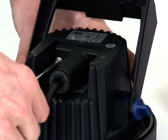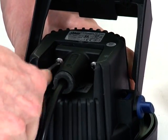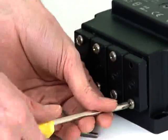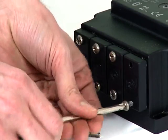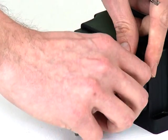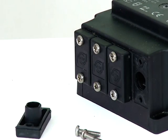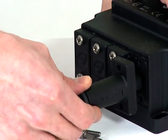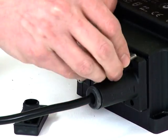To connect the cable to the light, insert the coupling into the rear of the light and screw into place using the two screws supplied. Repeat this procedure with the transformer. Remember that the transformer can be used for a maximum of 150 watts of illumination, so up to four 35-watt lights, three 50-watt lights or two 75-watt lights can be connected.